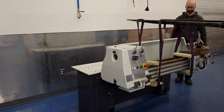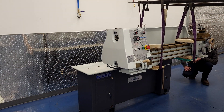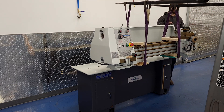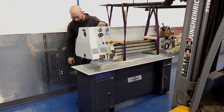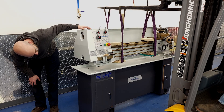So how do we lift the lathe? If you have access to a forklift, that's by far the easiest method, and the one we're showing first. Whatever lifting method you use, you're probably going to use two equal length straps with some pieces of wood that spread the lifting straps so that they don't put any pressure on the lead screw on the front of the ways, or the DRO scale on the back of the ways if one is installed.